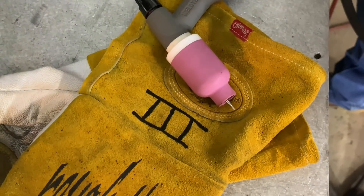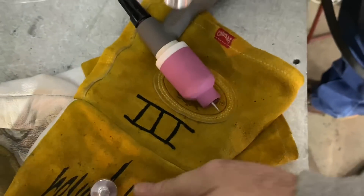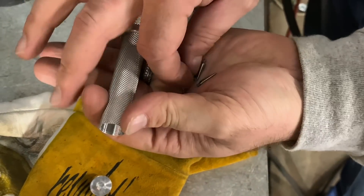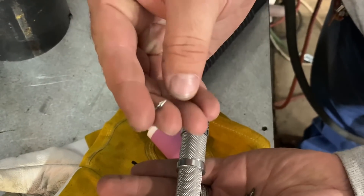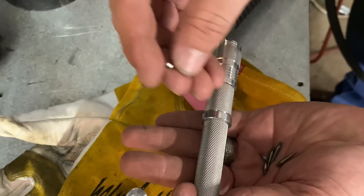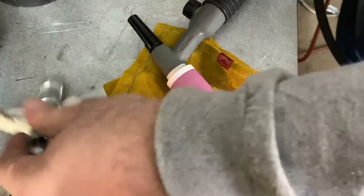We'd really like to show you guys this. It's been an honor and a privilege to try out these prototypes. These are actually tungsten tips that screw in and out, and they're all different angles for different stages of the weld. Some of them are a steep 60-degree angle for putting in a root, and then the other ones are laid back at a 10-degree angle for a cap pass or different things.